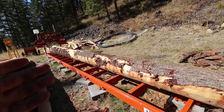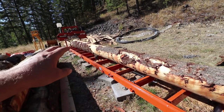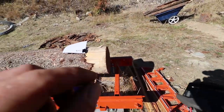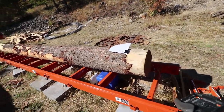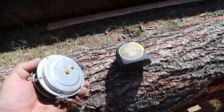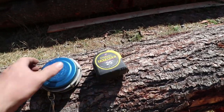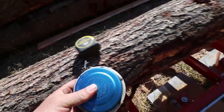I'm going to try to cut a log and see if we get anything fishy going on. We've already done a phenomenal amount of measuring — taken a square and a level, tape measured every cross member to the blade, checked across the side rails. It's funny how if there is an issue it's minuscule, but across 27 or 28 feet it presents itself as an odd-shaped timber. One tool we'll be using a lot is a logger's tape — we picked this up at an estate sale. It has a spike on the end and a belt loop, allowing for almost a no-hands operation.